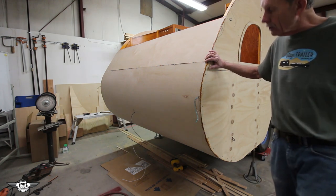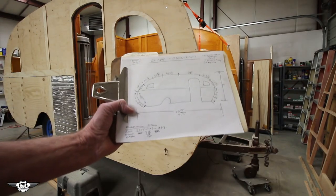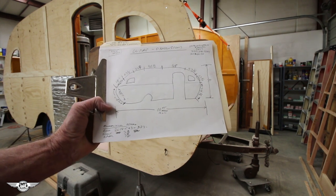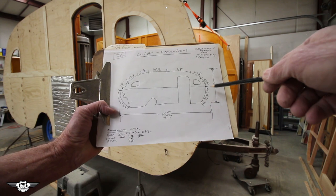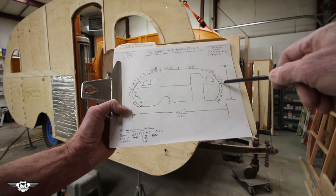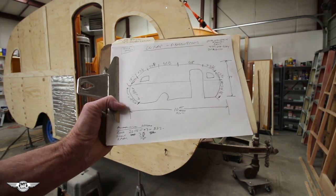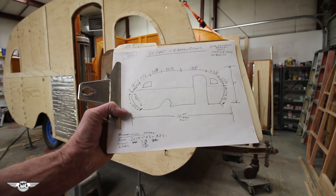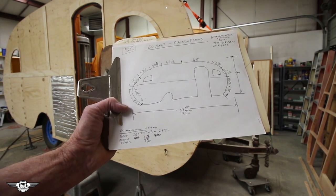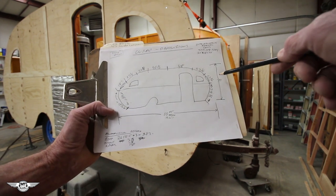There is the bottom part of the wrap for the rear. Now we're going to move to the front and get that on. This is a drawing I made way back when I disassembled this thing — remember disassembly and discovery? So I know where this first rafter goes: it centers on the same place where these two pieces of plywood come together. I did that in the rear, then there's another one 18 inches up, and another one 17 and a quarter inches up in the front. Why the difference? I don't know — it's just the way they built it, so I rebuild them the same way.